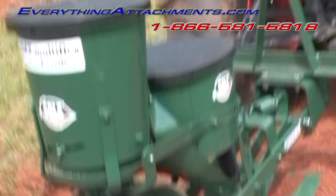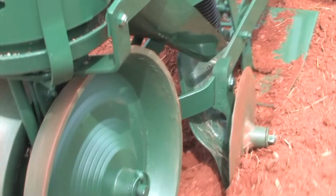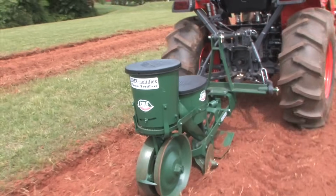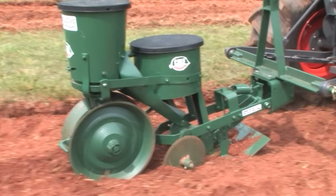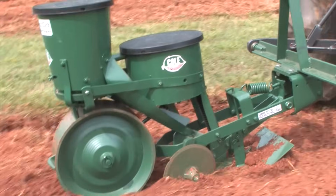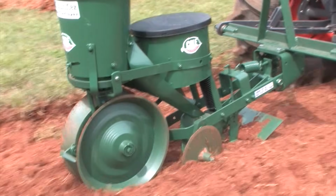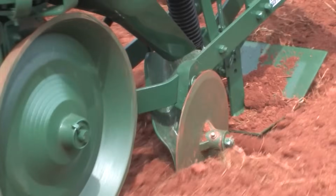If you go down too far in the front, that front plate will bury in the ground, and that's not what you want. You want it to be riding on the back wheel and that front plate, which is spring-loaded, to just follow the ground. So the next time somebody calls and doesn't know why their wheel keeps jamming, we'll know that there's a hunk of paint in the bottom of the plate seat. Perfect. It never missed a beat after getting that paint out.